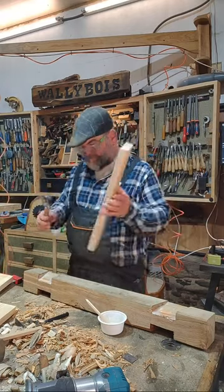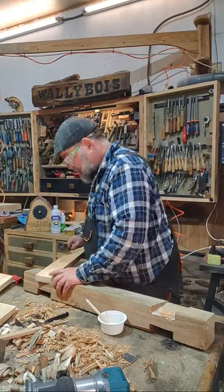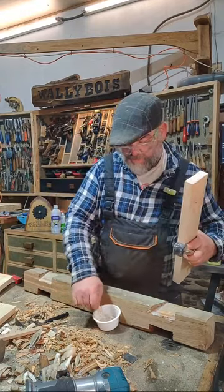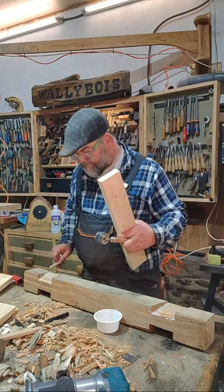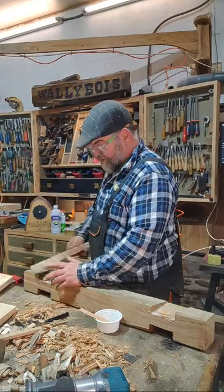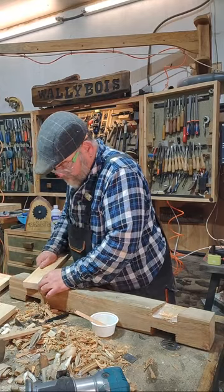Now, the legs aren't going to be in line with each other because they're going to be trimmed afterwards. The other thing about this Cascamite is when it goes off, it goes hard. So if you get any voids, for instance, that glue will harden where the voids are, and they won't compress. So I just find it really good, especially if you do mortise and tenon joints. I do like Cascamite for that.